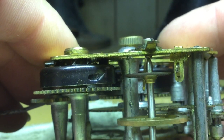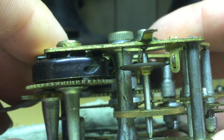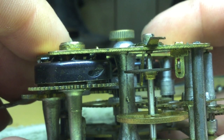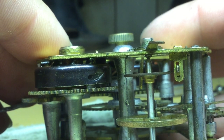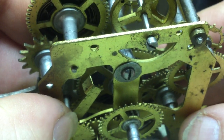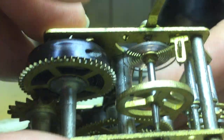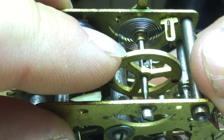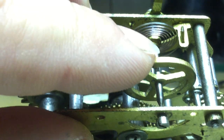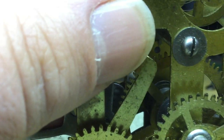So I'm back. What I did was take a little bit of time holding the movement up close to me where I was comfortable, not reaching around the camera, and I got the hairspring pinned. I went through some effort to get it pinned nice and flat, and it looks like it's pretty close to being in beat — just maybe a little bit off. What we can do to solve that is use a screwdriver in the slot of the collet to get it perfectly in beat, getting the length just right.